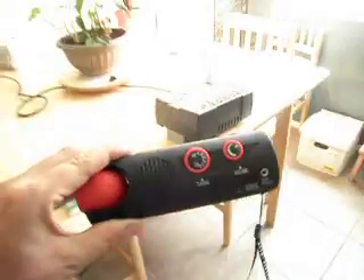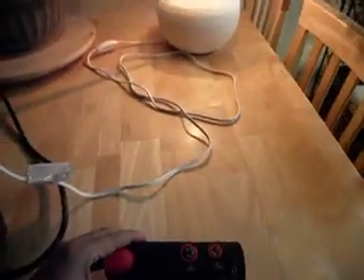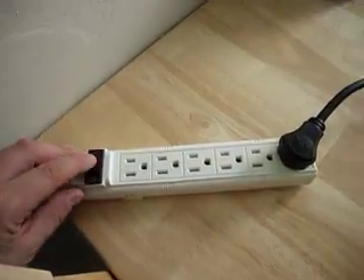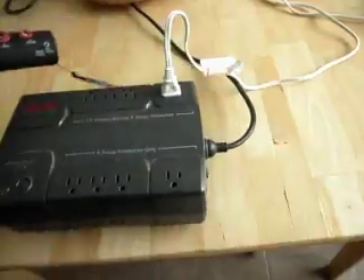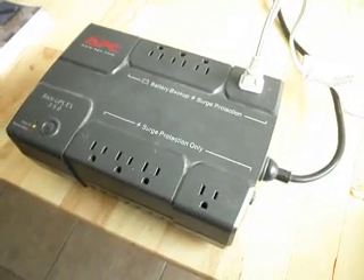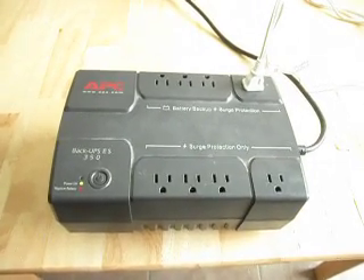These units do indeed put out electromagnetic interference on the AM band. We're going to reverse the process and switch off the unit. Our noise has stopped. I'm going to unplug it from the power supply — we're off at the power supply. There's very little noise around the unit now. So there you have it: inverter backup units do actually produce AM radio frequencies when they're in operation. I hope you enjoyed the presentation and I wish you the best of health. Thank you.